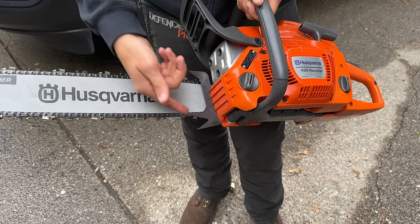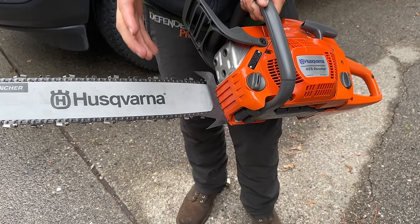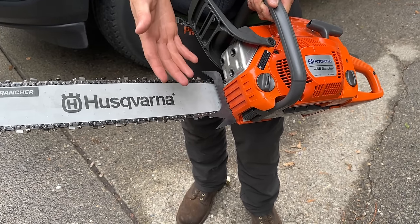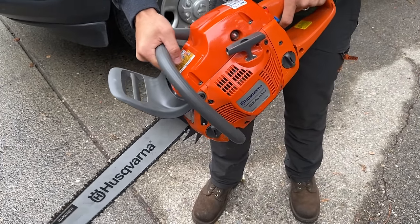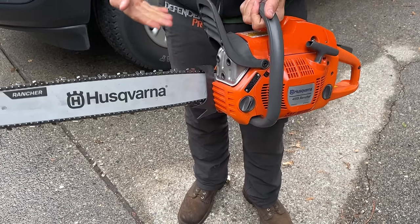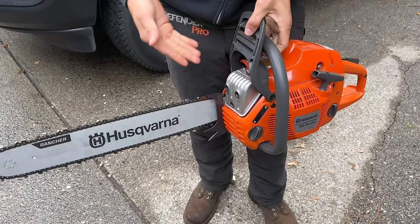And these are kind of aggressive. They're nice for the Pacific Northwest because we have very thick barked trees. What these dogs do is they allow you to grab with leverage, to cut more efficiently. It makes your life way easier because they call it dogging in. You can stick them into wood and then you can pivot the saw on the dogs rather than trying to just muscle everything. So if the saw is operating correctly, if your chain's sharp, and if you use your dogs, the chainsaw should do all the work itself. It's an auto feeding tool.